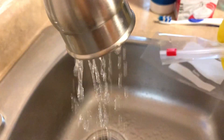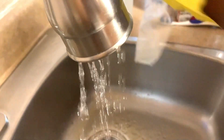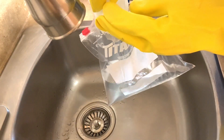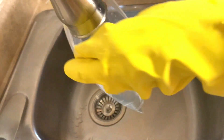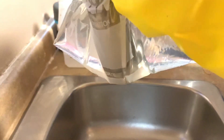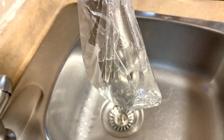This first hack is for all those taps that have a lot of lime buildup or salt buildup — you can see the water flow is reduced in my tap. What I'm gonna do is use a ziploc bag, pouring in just plain white vinegar, and I'm going to tie this bag to the tap. What this does is the vinegar will slowly melt the lime and salt buildup.